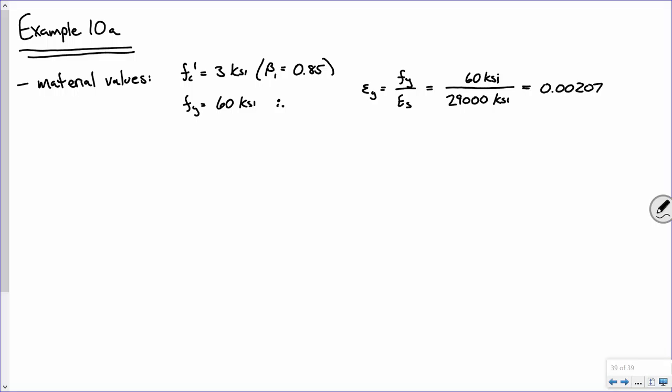We need this value because we're going to make an assumption that the steel yields. We need to determine whether or not that assumption is valid by comparing the strain against that. Okay, does that make sense? Everybody good? All right. So I'm going to put assuming compression steel